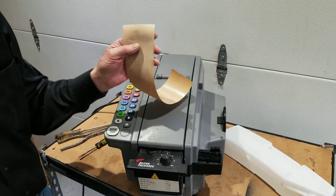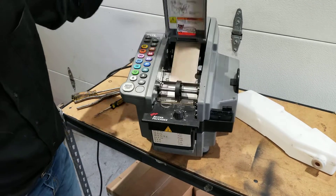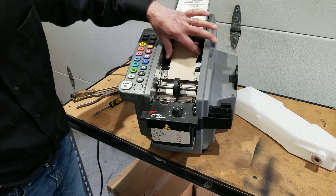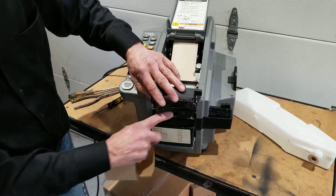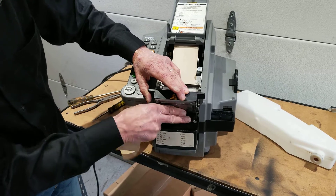We're going to show you how to replace your shear kit in our next video. But those are the main reasons why people get tape jams: not using the side guides, missing upper tape plate, worn or really dirty moistening brushes, and glue buildup in this area.